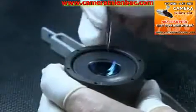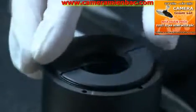Using tweezers, she coaxes the last lens into the barrel and installs a retaining ring to hold the stack of lenses down, then locks it into place. There's one final inspection — she examines the assembled optical lens from all angles. It takes a total of six weeks to make one of these optical lenses.